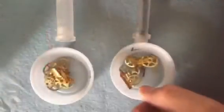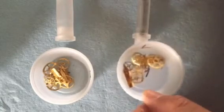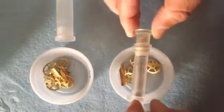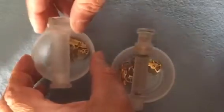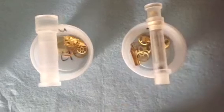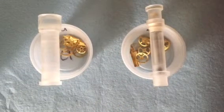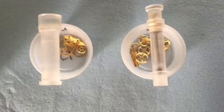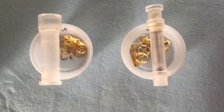I've got all my gears and nibs bent. This is the lower, and you can see the 'L' there so I know what side goes with which. I've got an upper for the cap marked so I know all those are bent for that diameter. Now it's just the process of gluing everything down — I'm going to use medium CA. That's going to take a day or so.